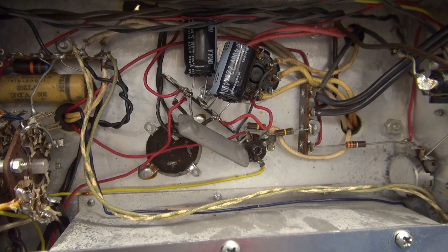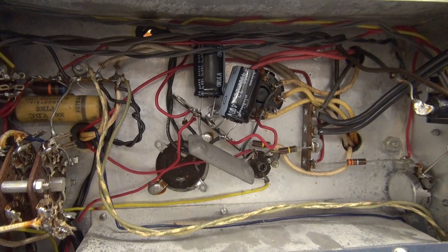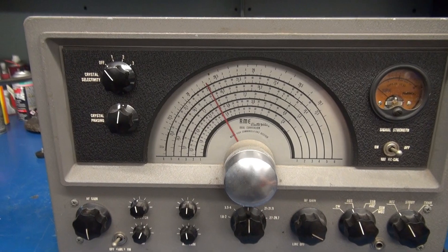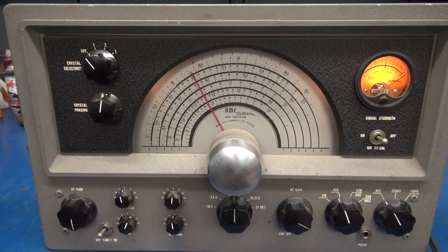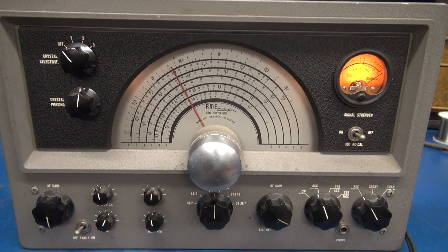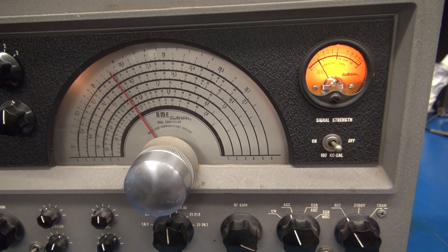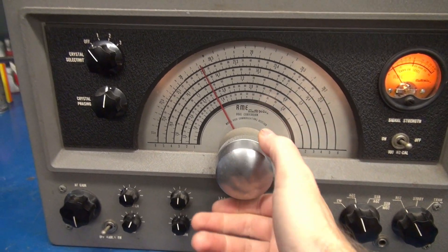It's time to power this thing up and see if I get anything out of it, which will determine if I'm going any further with the repair. Here we go — power up time. I did do an initial bumping of the power supply using my variac. The meter just swung to the left — that's good. Look at there.